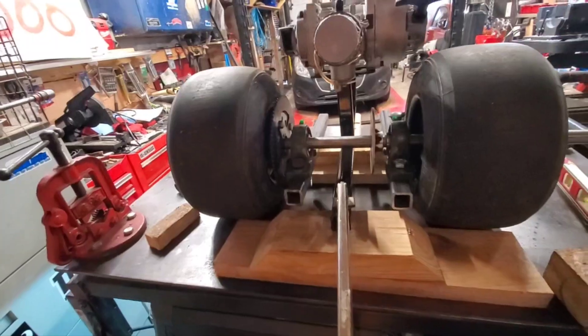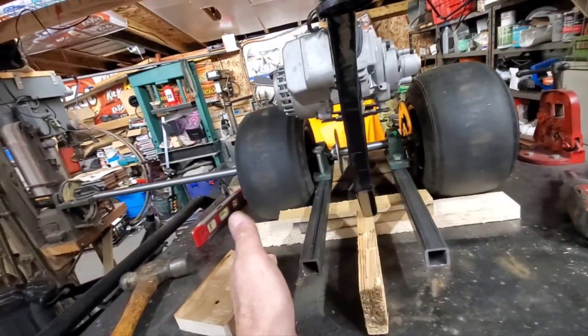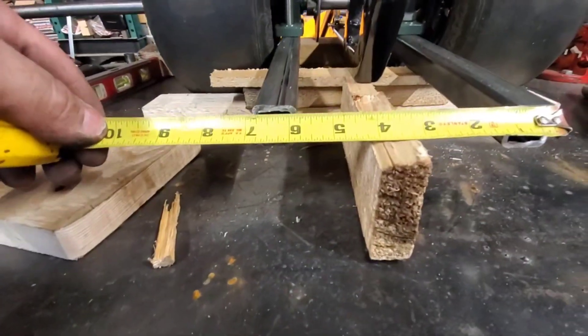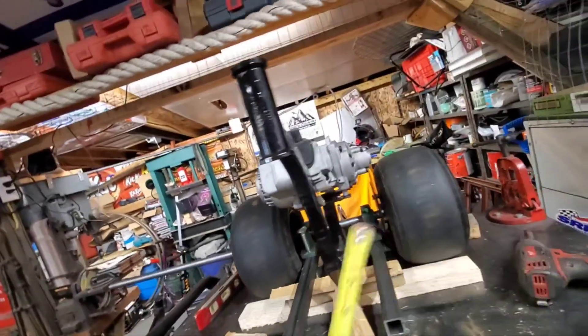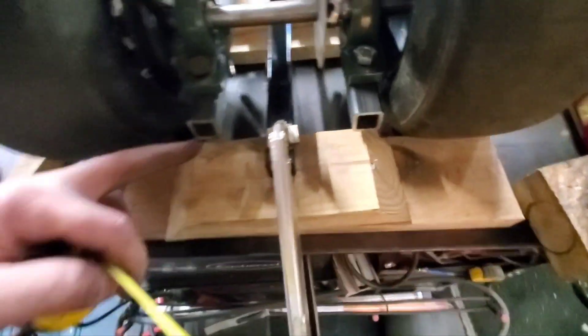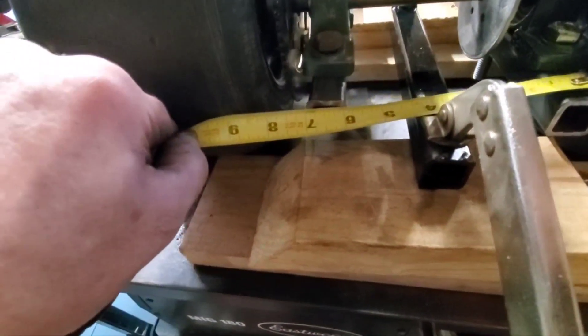It's under seven inches, which means something's cock-eyed — I think it's this side. It's hard without another person on the back half of the ruler. I'll make it seven and check the back. I got a clamp down in the back — that took a while, had to get my big clamp. I'll end up cutting straight across and welding one piece straight across the back. Did I get this at seven inches? Yep, seven inches — good.